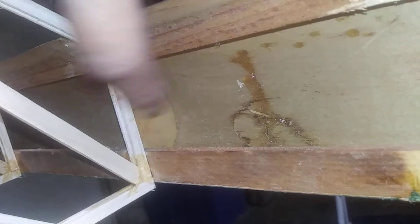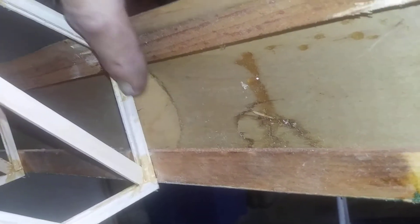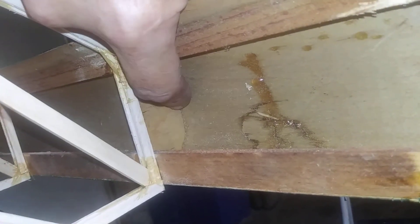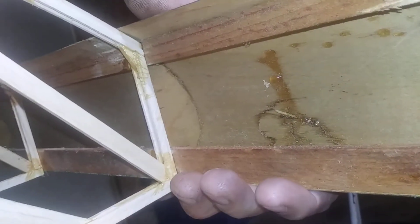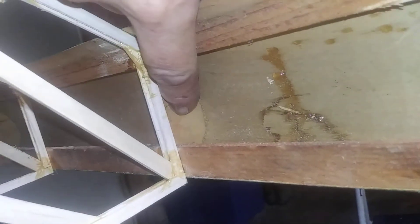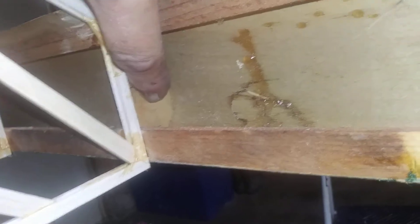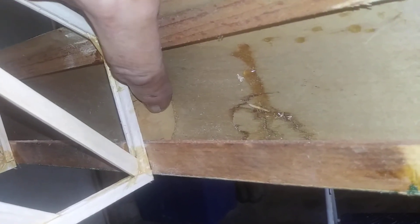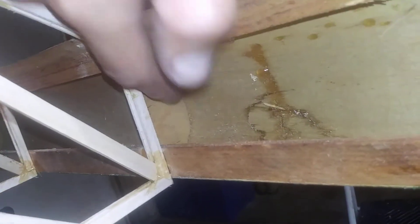After that, you go ahead and put your nose caps on. Normally the nose caps would be right in front of the ribs, but since this is a used leading edge, everything doesn't line up perfectly. Once the nose caps are on, you can wrap your leading edge material around. Note that some nose caps need to be a quarter-inch wide instead of an eighth — at the places where you splice the leading edge material.